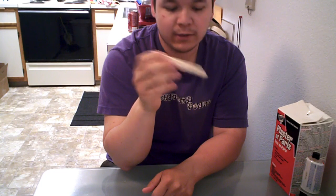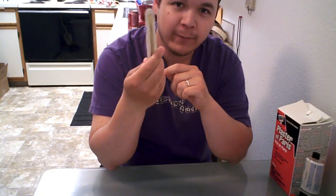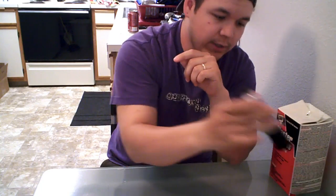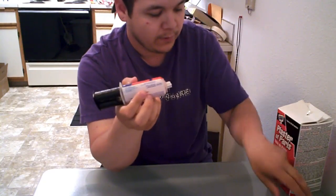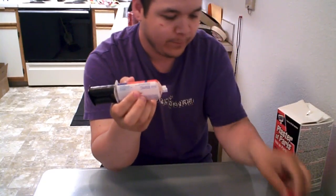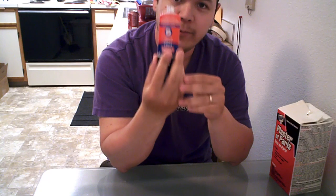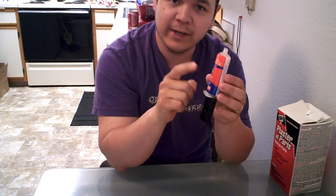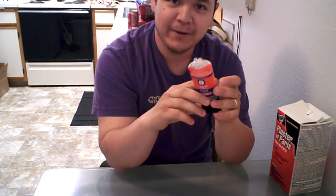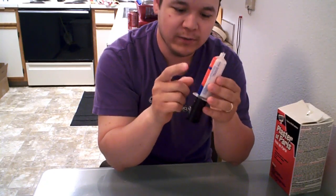After you get the full imprint in there, bake this in the oven for 12 to 15 minutes at 375 degrees. Once it cures, let it cool for about five minutes, then the epoxy comes in. Epoxy is a tube-based chemical glue — unlike super glue which dries instantly, or Elmer's glue which takes about an hour, this is a quick-set five-minute epoxy. You really have to work fast because once it's hardened, trust me, you do not want to get this on your counters or table.